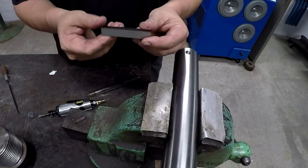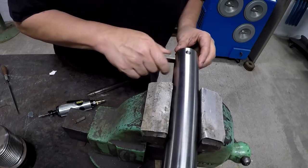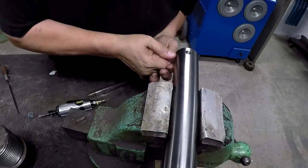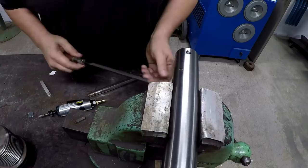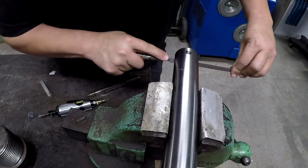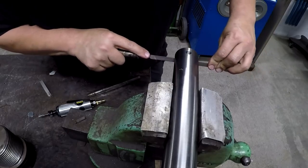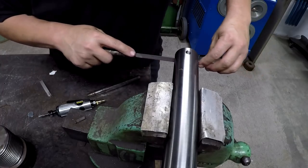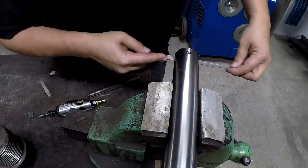That's a half inch tool bit, and even though we broached a half inch, it's a very tight fit. So I'm going in there and I'm just lightly filing it, trying to open it up just a little bit. And where's one of those fancy die filers when you need one? Who was it that said that they aren't worth having?